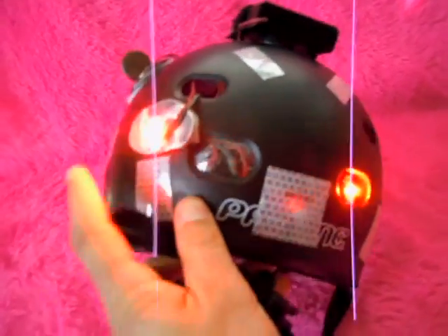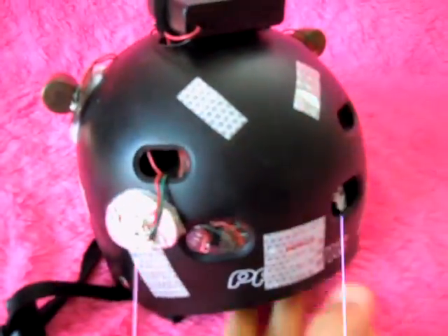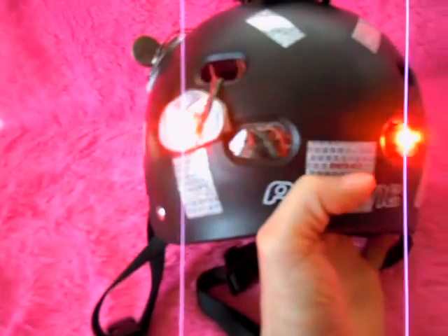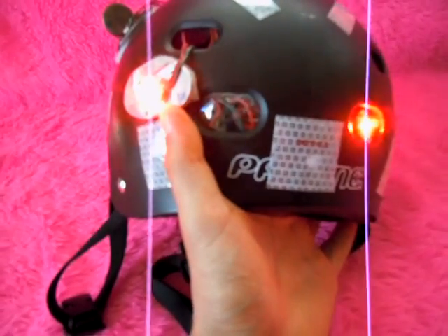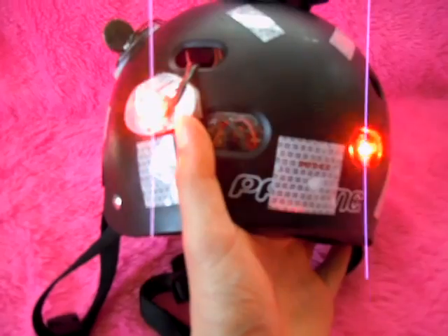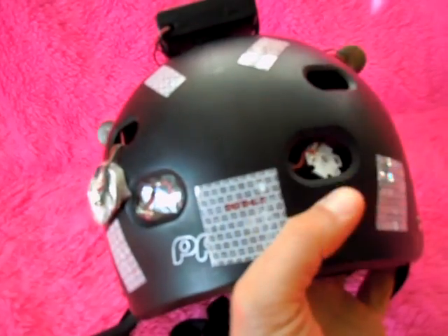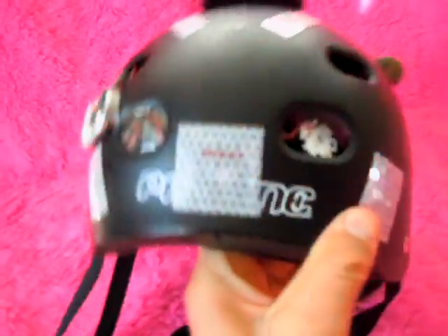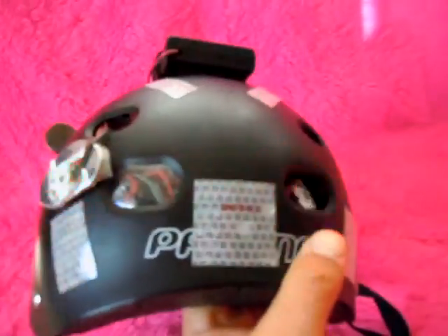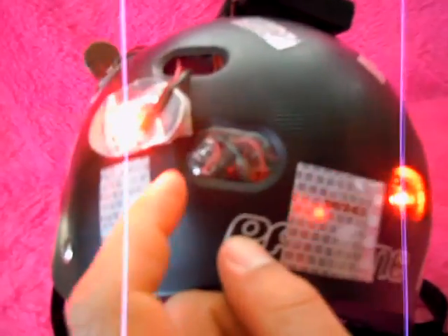In the back, I've got those red flasher lights. This one is on a heatsink — also velcroed on here — and this one is just free floating. I glued this one with thermal epoxy onto diamond plate aluminum, and I tried this one just free floating. But it doesn't get hot and it hasn't burned out, so next time I'll just use the starboard itself for these red ones, because they're intermittent — not blasting on all the time — so they have enough time to cool off.